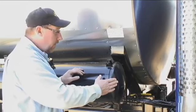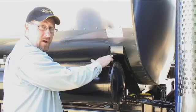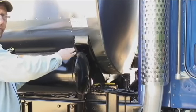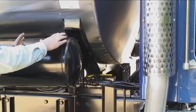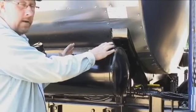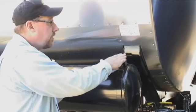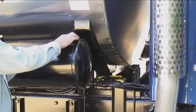Located in front of the diesel tank on the right-hand side are the valves that control the optional anti-freeze asphalt pump heating system. This tag explains how the valves should be set. Basically, we're taking truck antifreeze and running it through a heat jacket around our asphalt pump, around our sump, and around our drop tubes on our circulating system, so that the antifreeze is preheating that material to 200 degrees prior to putting asphalt in the pump. Please refer to your operation manual or this tag for the correct valve positions to turn the system on or off.